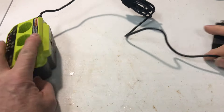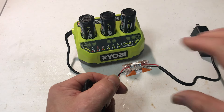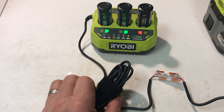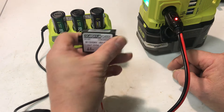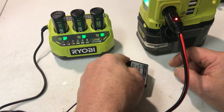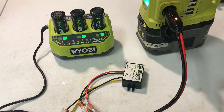The first thing I did is I just cut this cord and stripped the two ends, then I just used these lever nuts to connect the AC adapter back. Then I just verified that the charger still worked with the AC adapter. Most people will want to use a 12 volt cigarette lighter to charge their small batteries, so you can get these nice little DC to DC converters that have a wide input range of 8 to 40 volts and it outputs 5 volts at 5 amps. It works nicely — I'm using my Ryobi power source as a test source.